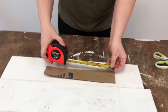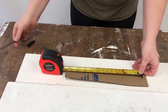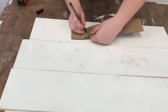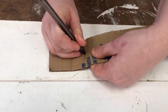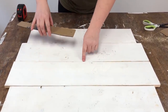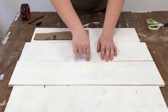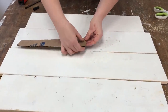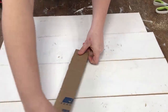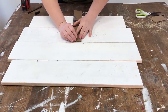Measuring back from my nail, I'm going to make a line at nine inches — which is half of 18 inches — so that I can make a circle that's 18 inches wide. I'll just poke a small hole with my writing utensil; you can use a pen or a pencil. Using my slats, I'm going to offset just a little bit from where one of my main slats is, because where I'm going to put the clock mechanism I don't want to drill a hole right where my slats join together. I'll make sure I have enough room all the way around for nine inches.